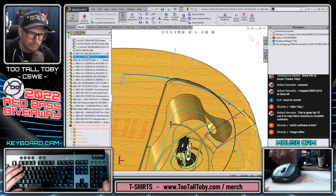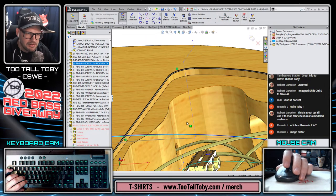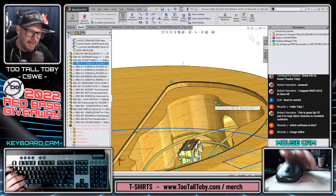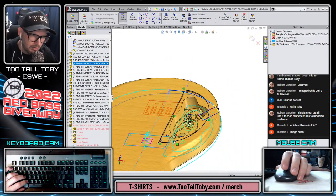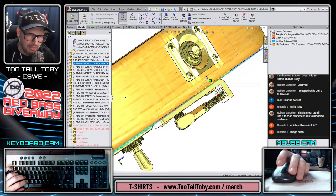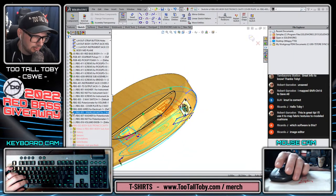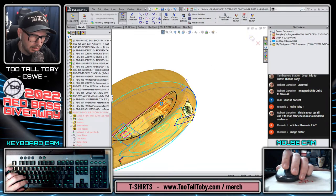And then that'll be the actual main sketch for that electronics enclosure depth, you know, the actual pocket that we're creating there. Because it's not going to be exactly one for one. There is going to be a very subtle amount of clearance for that actual cover plate. And then I think I have some sketches that represent the depth of some of these different areas. Yeah, like right here, here's the depth of the electronics enclosure pocket. So then I would do an extrude cut from that sketch. Uh-oh. Why can I not do an extrude cut?